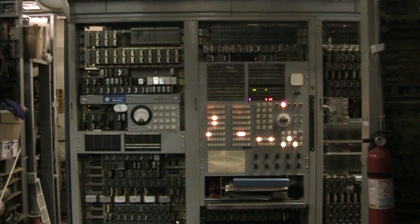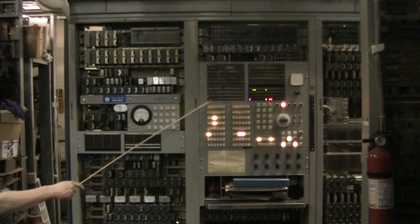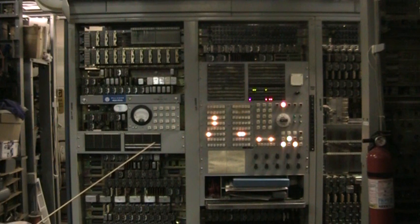At this point, the flashing lights on the master test frame indicate that I have equipment that is temporarily out of service, made busy. The master test frame had the ability to set up calls, monitor calls, and record troubles, such as if there was a failed marker or a register and so forth. It would light up different lights telling you what had failed. It also has the ability to test the trunks locally or make them busy. This was a very sophisticated system for its size.